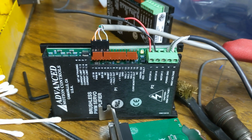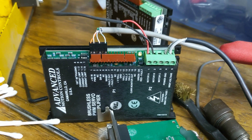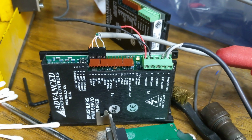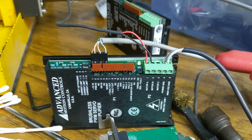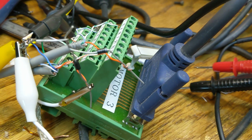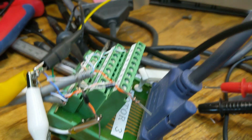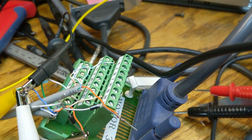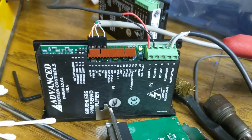It didn't work, because these things sink the inhibit, direction in, and PWM in. So if I supplied 5 volts to this, it didn't work because it never actually shut off. So I ended up cheap and dirty, running 2 diodes in series with what runs from the 5 volts into the supply for the servo drive, and that seemed to work.